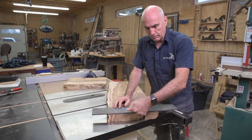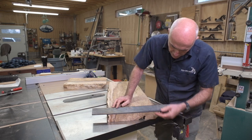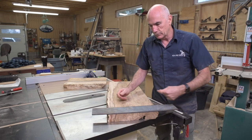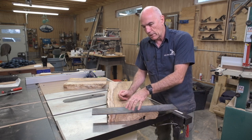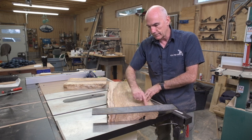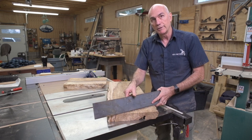I'm going to use 4-inch strap to make the legs on this side using a thicker material. I want to kind of surround the piece of wood at the top and the bottom and continue down to the legs. It's going to surround the slab, but I also want it to be flush on top. So I'm going to route down — I'll just use the CNC — the thickness of the material I'm going to be using.